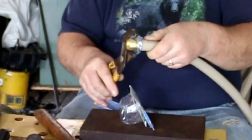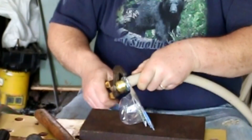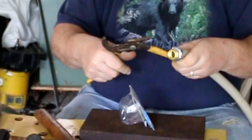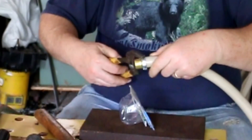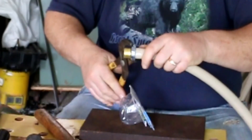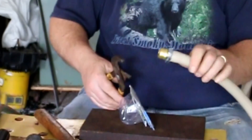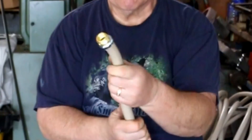Go on around and do the next one, and the next one, all the way around the hose. Now this one, because of the size of the hose, I have to come around and take another bite on it and hit it again. I don't want to punch it all the way through, but I want to make sure it seats into the hose — no point cutting the hose in half, just seating the barb in it. There, that's going to work just fine.